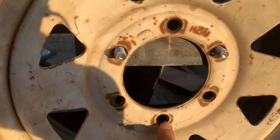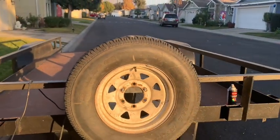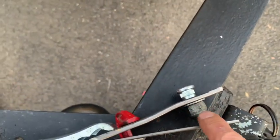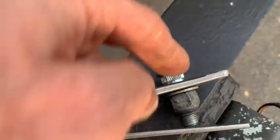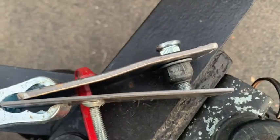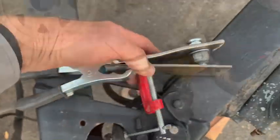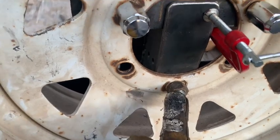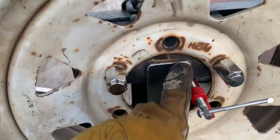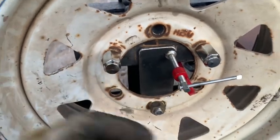Now we've got to work on our bolt down here — it's going to be a T-piece that comes down here, then we'll tie it back in here to stiffen it up, and that will finish this all off. We're welding up this piece — it goes in there, we've got the stud, we've got a little bend in this piece so it sits in here. Hindsight 2020: putting a half-inch washer in, then the lug nut, gets this stud nice and straight and square — that would have been a great thing to do ahead of time. We've got this set up on the cross piece, clamped in place, we'll tack it on here, and then put a reinforcement on the back side.